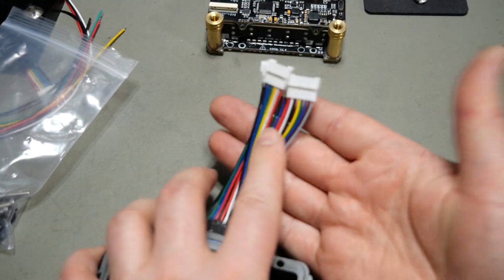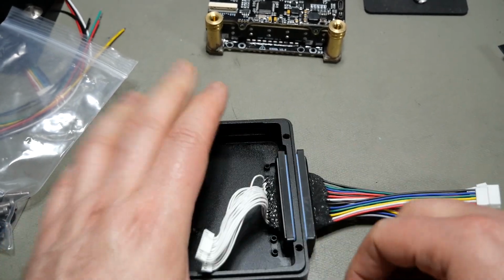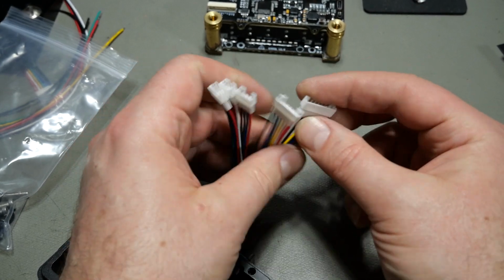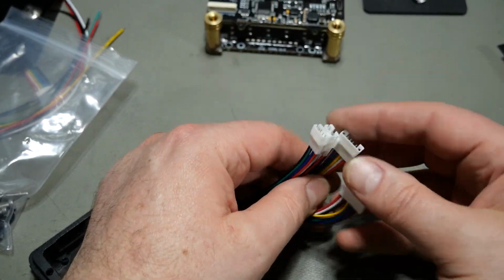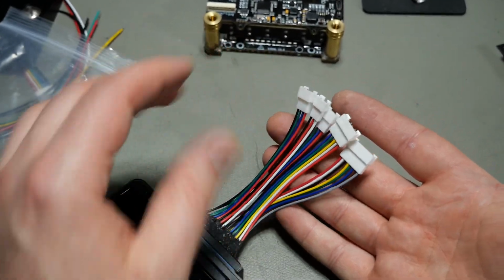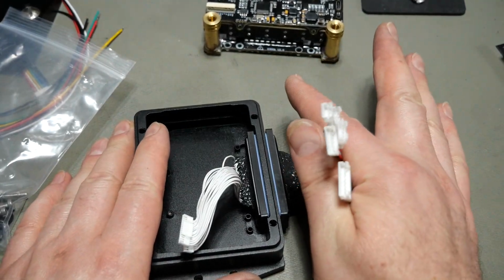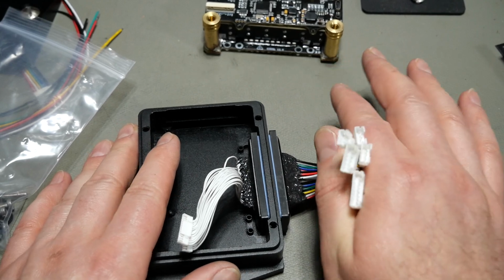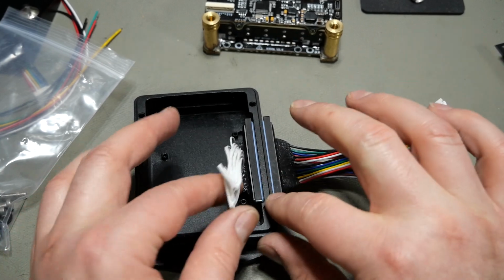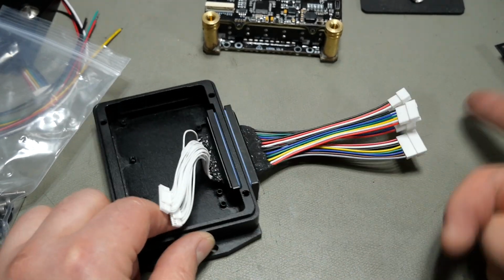And also, you've got way too many connectors here. This is connector number 1 to the logic board. Here's connector number 2. Some things plug directly into here. Other things like, say, the COM port, you've got 4 connectors before you ever even leave the controller, and then you've got whatever else after that. So lots and lots of connector possibilities for creating failures. And JST is not exactly waterproof or really tough or resilient. So lots of these is not really good, and these are probably going to be okay inside the shell. But you've got way too many connectors in here.